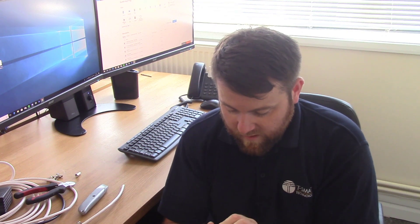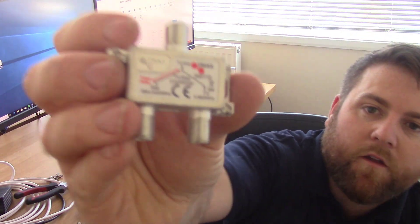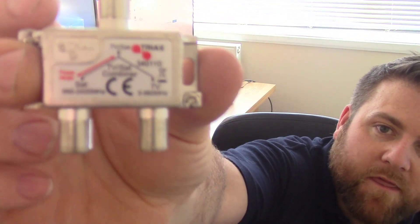I'm going to show you a couple I've got here. This one here is a TV and satellite combiner. That will combine a satellite signal and a TV aerial signal all onto one cable, which is great if you've got trouble trying to get more cables to the rooms. You can see the little red line on the satellite side — that indicates it's got a power pass on that leg. The way satellite signals work, you need to put power up the cable to actually get the signals back, to power the LNB or whatever equipment is doing the switching or distributing the satellite signal.